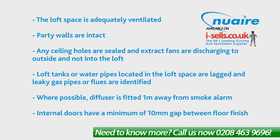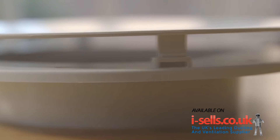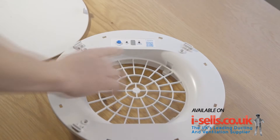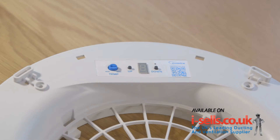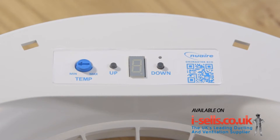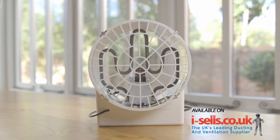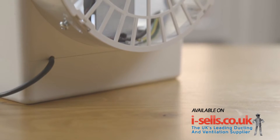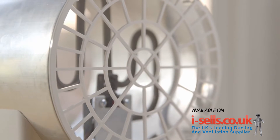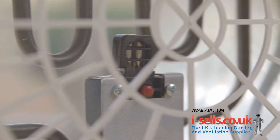Let's start with what's in the box. The new circular diffuser is unique to the market — not only is it more aesthetically pleasing, but its shape makes it easier to line up when installing. The control interface is housed within the diffuser to allow adjustment of speed, heater and unit temperature control, so it can be set and adjusted from the hallway without having to access the loft. The DryMaster EcoHeat has a 400W thermostatically controlled heater which is designed to fit directly to the diffuser. This unique feature provides minimal heat loss as the air is heated at the point of input on the unit. This new design creates a quick and simple install using less energy than a conventional PIV system with integral heater.